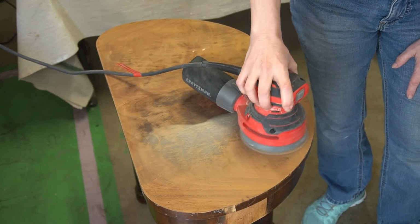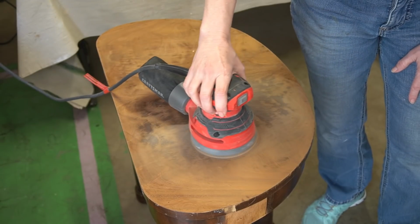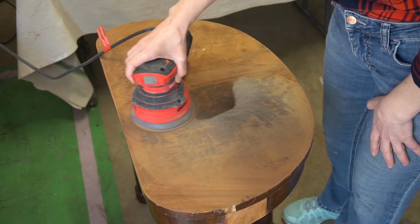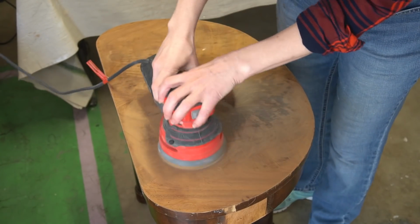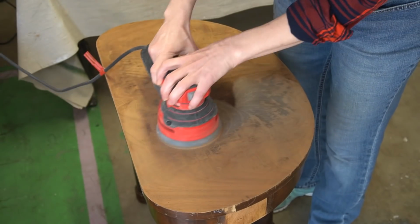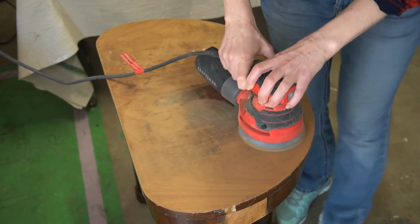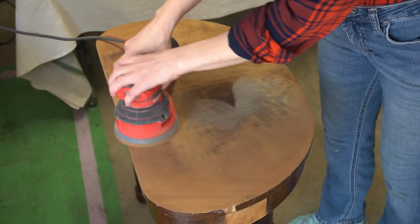The more I could avoid blowing through the veneer, the better, especially on top, but edges are notoriously precarious. In fact, I know this piece was refinished once before. I didn't get it on camera, but when I hand sanded the top apron, there were already places where the edges or corners dulled into the wood beneath. Luckily, this table is just for me, so I don't really mind, but it did kind of ruin my plans for a perfect refinish.